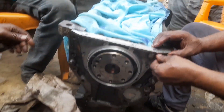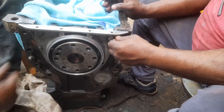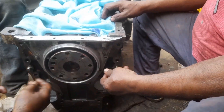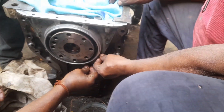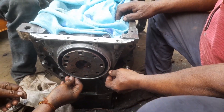Today I show you how to fit the RC plate, which means rear cover plate, in the Komatsu engine. The process is: first we put the gasket, then we fit the RC plate on the cylinder block, and after that we engage all the cap screws and tighten the RC plate.